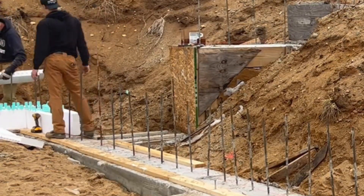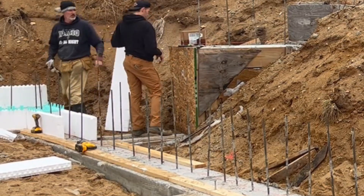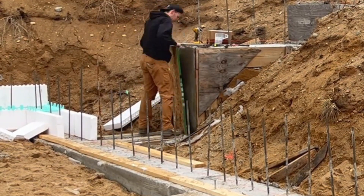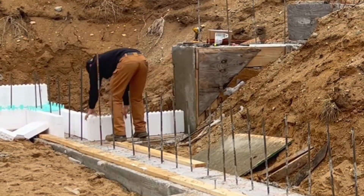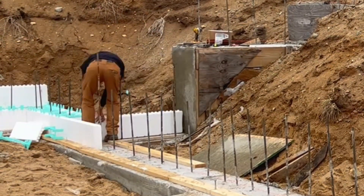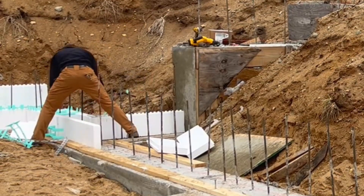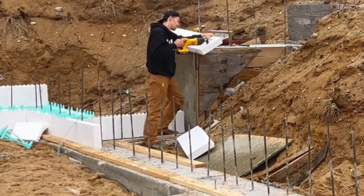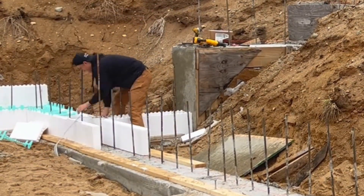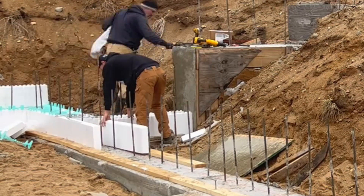With another section of form stripped, we're now ready to put more Quad Locks down. I'm finding that it's easy working with Kyle because he knows the system so well — I can even hand him the toughest part of the process and he handles it with ease. When you come to a corner, you have to think about how you're going to make the transition from your pattern to the right length of panel going into the corner, and then the corner itself has some metal brackets that you add, and you take the nylon tie and trim them a bit to fit and add some strength to the corner.